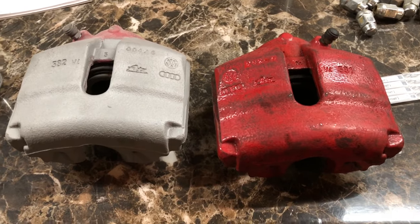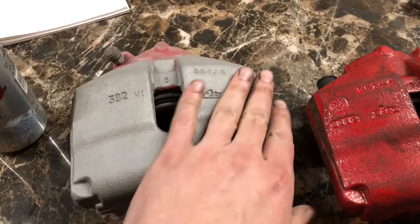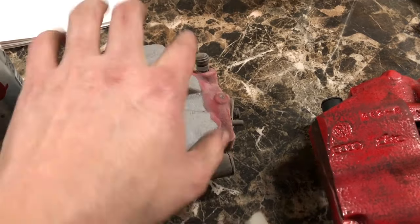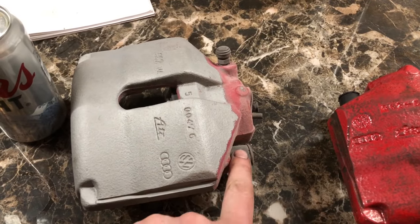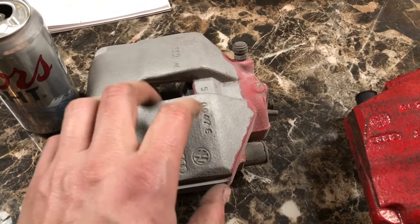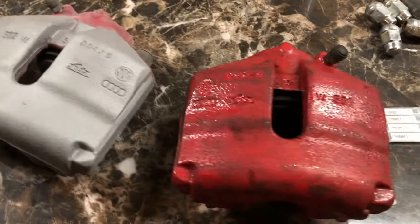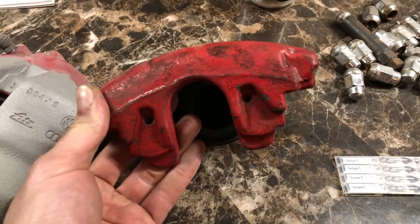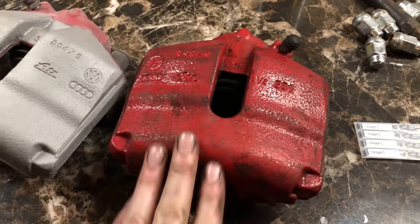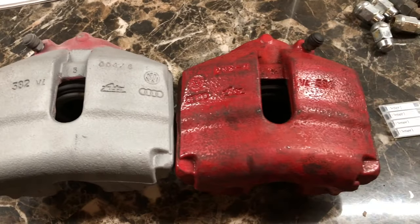Here's a little before and after. This is after the media blast — as you can see we got it pretty well cleaned up. We did leave a little bit of paint on the back because there are rubber grommets and covers back there, so we just briefly hit it with the sandblaster to get the top layer off — painting over that will be no problem. And here's one before the media blast — just completely awful. Keep in mind I did a chemical bath on this one, so it should have stripped more than it did. It really did need the media blast to get ready for paint.